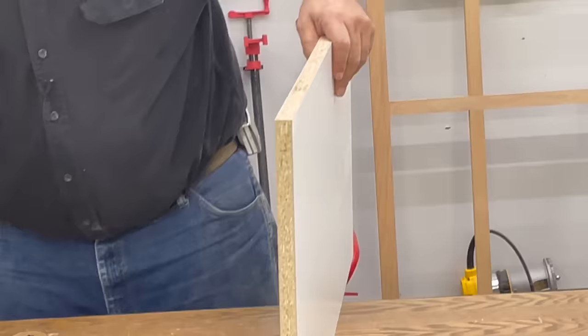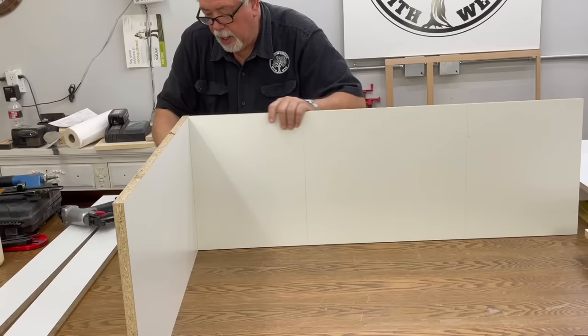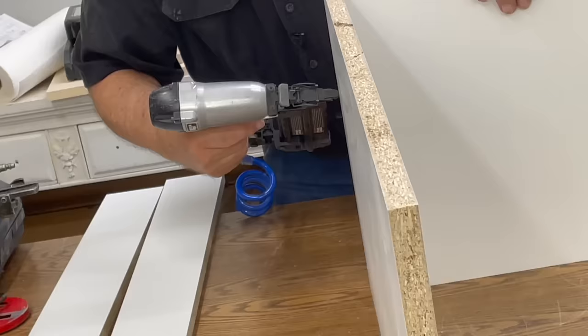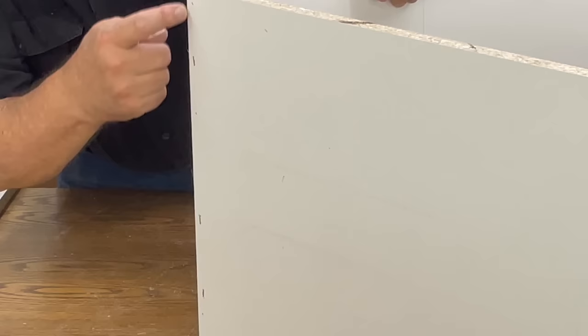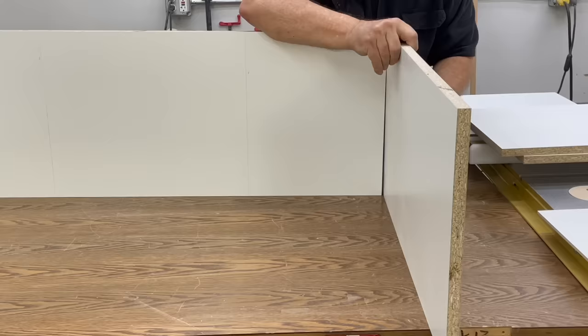These are my end panels and these are my uprights that are in the center. When I assemble cabinets I use an 18 gauge inch-and-three-quarter nail to begin my assembly. All of this is three-quarter inch two-sided white melamine that we're using for the interior of our cabinet. I put a few nails in there to hold it in place, and then what really holds the panel in place is these inch-and-three-quarter wide crown staples. You can see where I've used my inch-and-three-quarter brad nail and now my inch-and-three-quarter large crown staple — so now my side is stapled in there.